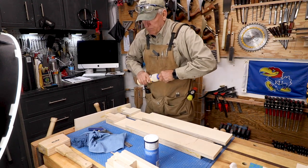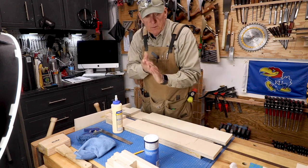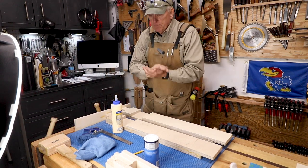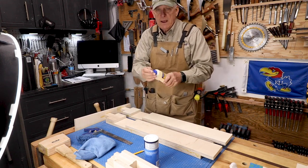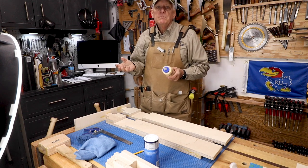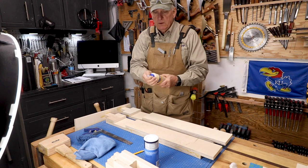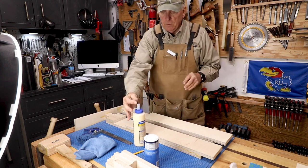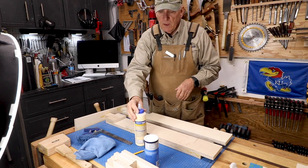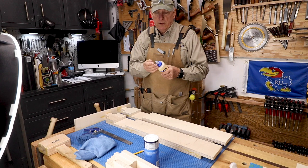So I'm going to do a little glue-up here. I've got a wet rag and a dry rag. Once you get the glue spread around, put the piece back down and wipe it — it's called wiping the baby's butt, from Next Level Carpenter, that's how I remember it. You would never change the baby's diaper without wiping first, and the same thing is true here. Don't pull this up and do a whole glue job and set it down loosely. Close it every time, wipe it every time with your wet rag and keep it nice and clean.